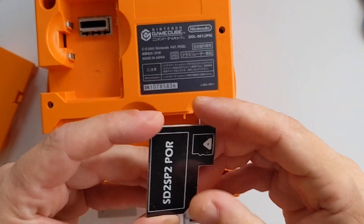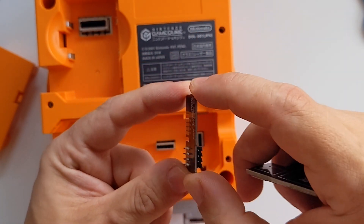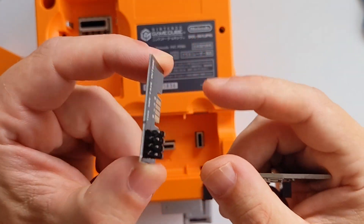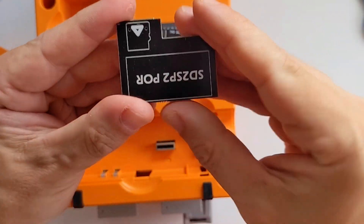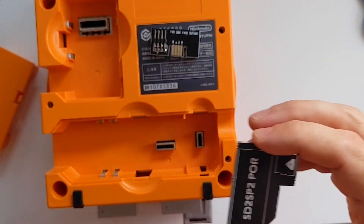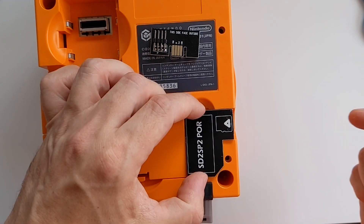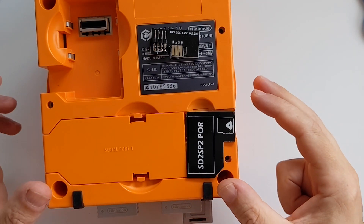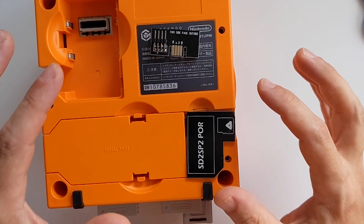So there are two changes that need to be made. The first modification is the thickness of this PCB — it's too thin, it wobbles about, and you don't get a steady connection on the serial port 2. Secondly, it's not quite the right shape. What we want is for this to be a neat flush fit when serial port 2 is in place so it doesn't wobble about when we insert or eject the SD card, but we don't want any excess pressure from forcing it. We want everything to fit just neatly.